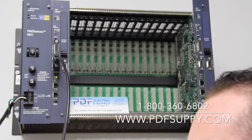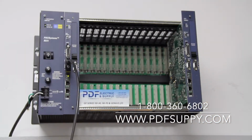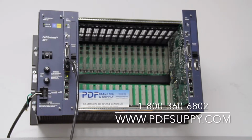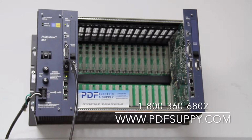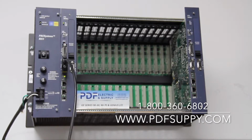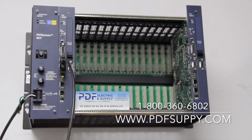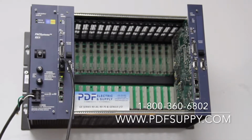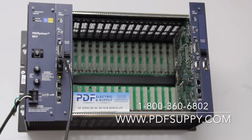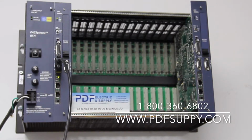If there's no feedback that's helpful, the second thing I would do is go back to target, online commands, and I would clear very specifically controller fault table and I/O fault table. And then I would download and run. This allows me to clear out any controller and I/O faults and get the processor back in run mode. Let it go through its full programming process. And the whole idea is I want to try to get the processor back into run mode.